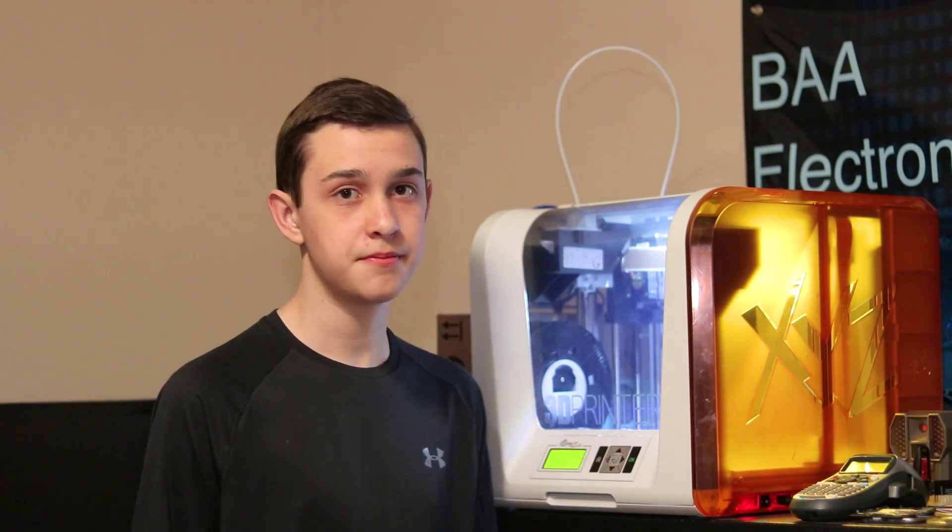The first major thing — and this may sound very simple but it's very essential — is to update its firmware. The printer comes shipped with firmware 1.0.4, and the newest version at the time of this recording is 2.2.7. There are a ton of improvements, such as the loading and unloading of the filament, the speed of the Z-axis, and even the specific nozzle diameter of the extruder. All of this had to be configured manually in version 1.0.4, but 2.2.7 seems to fix pretty much a lot of the problems I've had over the past two years. I just plugged in the USB cable and it said firmware update.